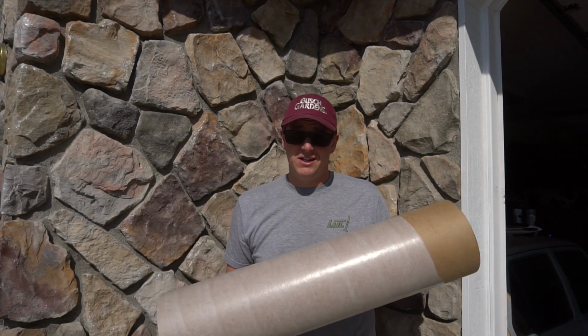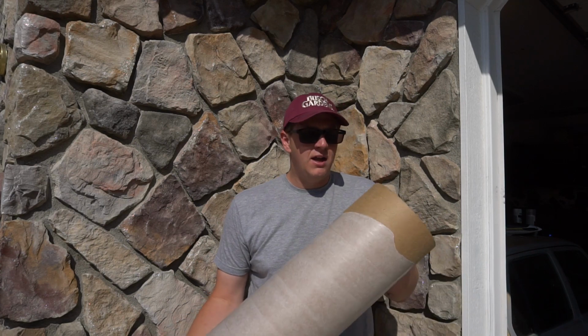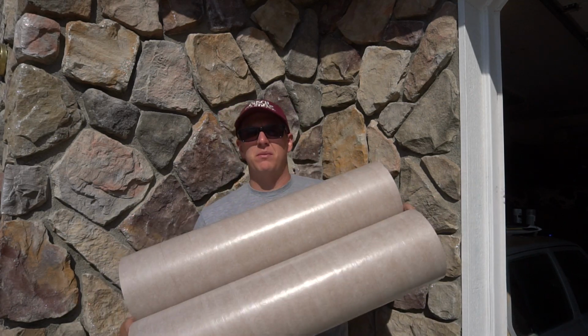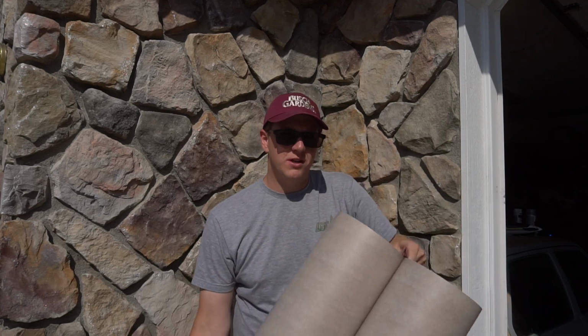So today I'm going to teach you guys how to fiberglass a big diameter tube like this one. And when I say teach, take that with a grain of salt because I've never done one this big before. There's 4 tubes that make up this kit, and I have enough ABS pipe laid out on my little fiberglassing jig over here that I could do 2 at once.